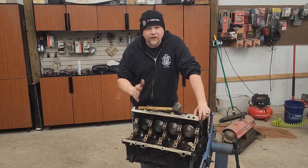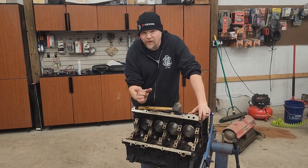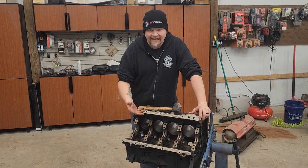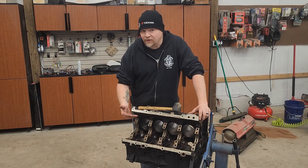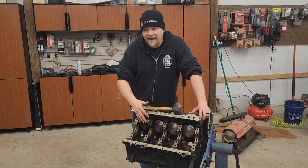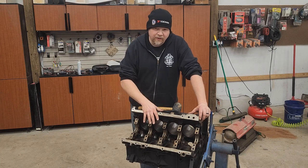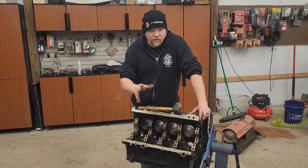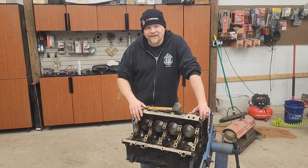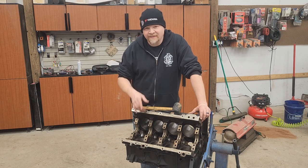That's about all there is to installing cam bearings. LS's are pretty easy - they've only got three different sizes. Your late model Hemi engine has a really large front cam bearing, about two and a half inches long - it's very difficult to remove, you usually have to split it and bend it to get it out, and installing a new one is equally difficult. LS's are pretty simple. You usually don't have to do this unless you have significant wear like we did, or if you're doing machining on your block and need a deep clean. This is a pretty simple project - anybody can do it in about two to three hours with a disassembled block. Make sure you click subscribe and we'll see you next time.